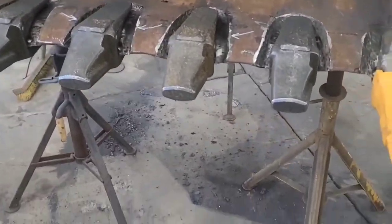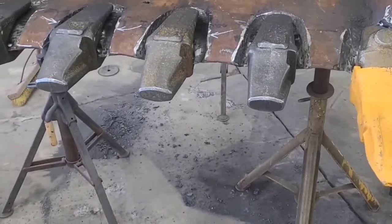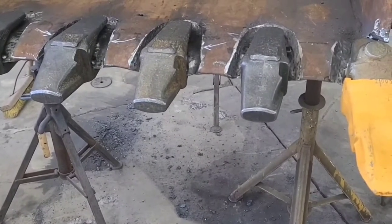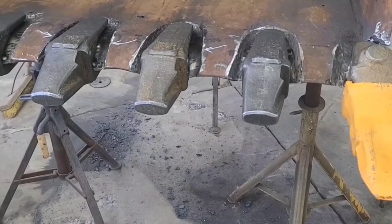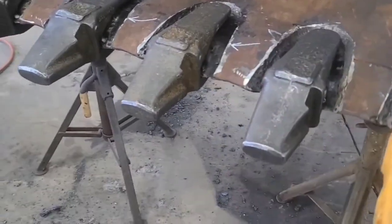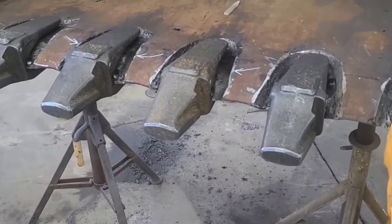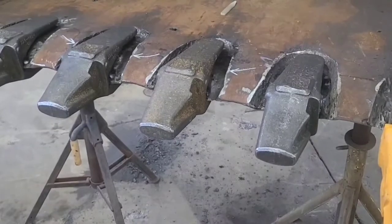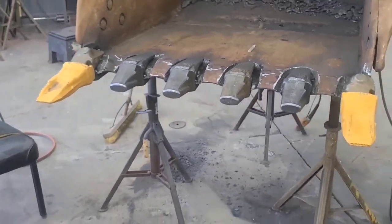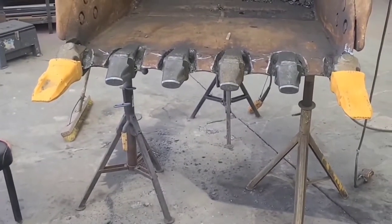I can tell you what I'm going to do. I'm going to cut these cracks completely out. I'm going to take the torch and the carbon arc. I'm going to probably torch from this side and blow completely through where that crack is, and I'll weld it up on this side. Then I'll go to the other side, probably with a carbon arc, and back gouge until I reach my weld, and then fill that up. And then we'll have no cracks. So that's good. Let's do it.